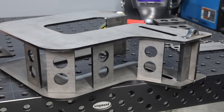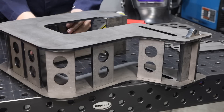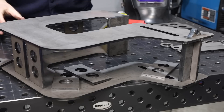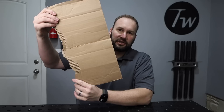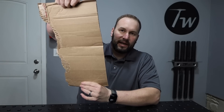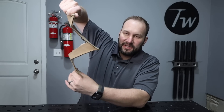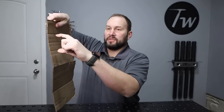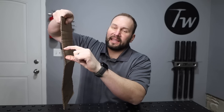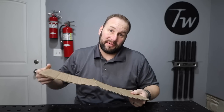Turning my attention back to the mainframe, I'm going to put in some stiffeners. There's a very specific reason: the load is all transferred through bending in the back. I'm lifting up on the front, pushing down on the bottom, and it will bend it this way. It's pretty stiff in bending, except that as I bend it, the material can actually buckle down out of plane, and I want to prevent that. If I put those stiffeners all the way along, I reduce the length — you can think of it like a column on the back — and that'll keep that from happening and keep everything intact.